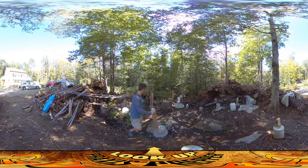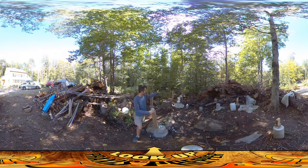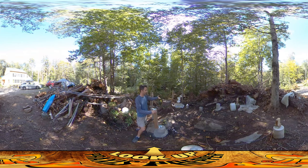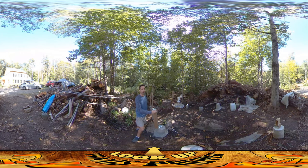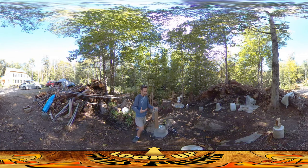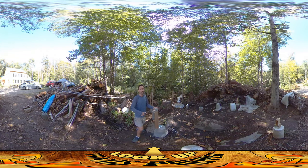So what I'm doing is putting all these legs on. I've got all the feet in. You can see the last one I did over there still wrapped in plastic wrap, with a bucket on top. The bucket is so when it rains, I'm not getting water pooling in the top, and the plastic wrap tries to keep whatever warmth is happening during the cure in there, because concrete works best to harden up when it's a reasonable temperature — you usually want to do it above 50 degrees, and tonight is going to be the first night below 50.